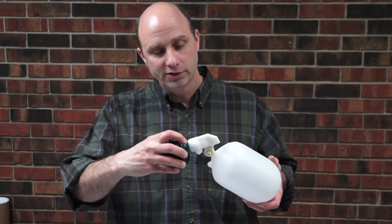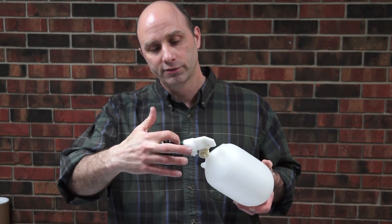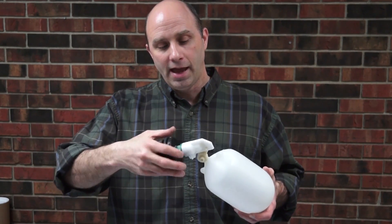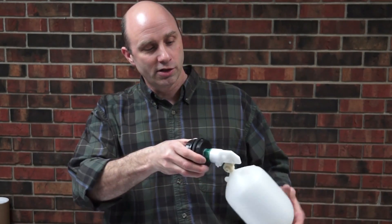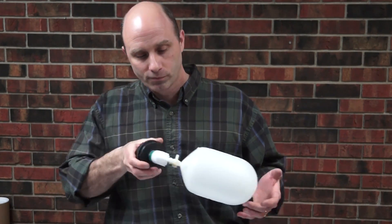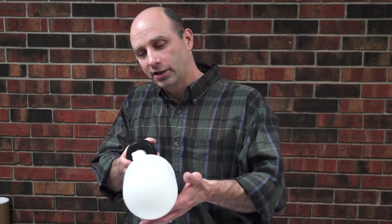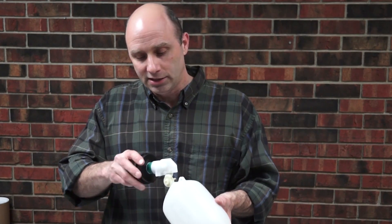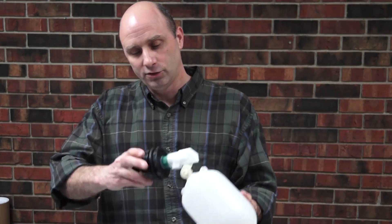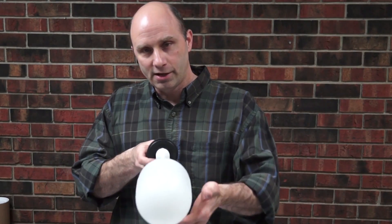With these valves, there is a gasket between the valve body and the valve orifice. If that gets misplaced — sometimes it can get turned off to the side — your float isn't going to be running straight vertical up and down. That can create some binding issues. So we want to make sure that it is oriented correctly so that it is operating straight up and down.